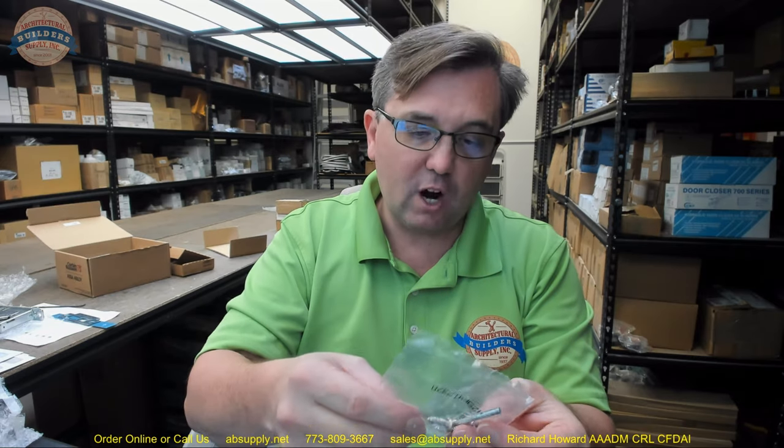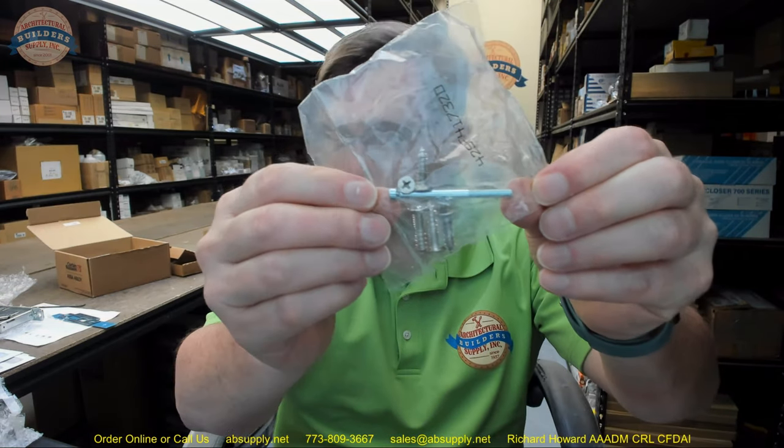The interior, as you can see, has two dimpled holes. Screws will run through the door itself and into the brazed bronze bushings on the inside that are drilled and tapped. After that you're going to get your screw package: screws for the strike, screws for the lock body, screws for the armor front, and one funny screw which we will talk about when we get to the installation instructions. Now let's review the link below this video to the cut sheet, the product catalog, the installation instructions, and the template.